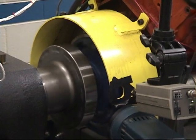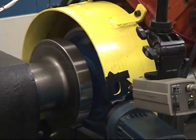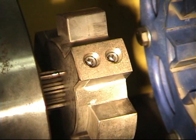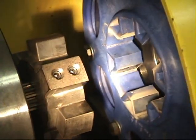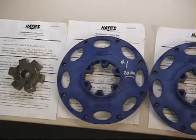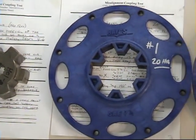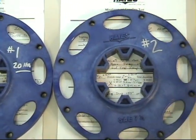This component showed no signs of wear. Another important thing that we checked was that the hub had not changed its position on the spline shaft. During the course of this test, each coupling saw 2,808,000 bending moment cycles. These tests have given our customer the confidence to proceed with the Hays product. Currently on this application, we have shipped more than 7,400 pieces with zero failures, and more than twice that number on other applications that we are now doing for them.